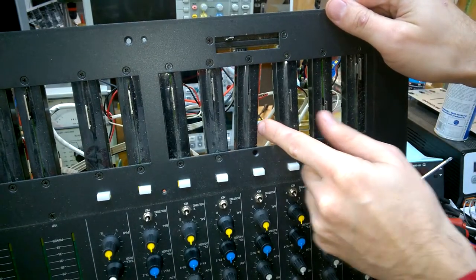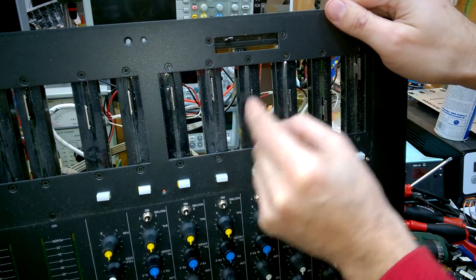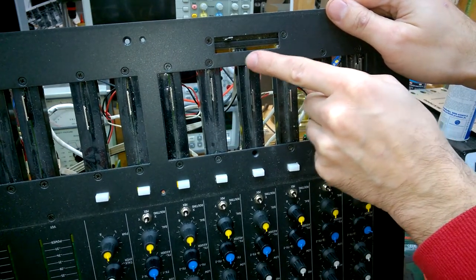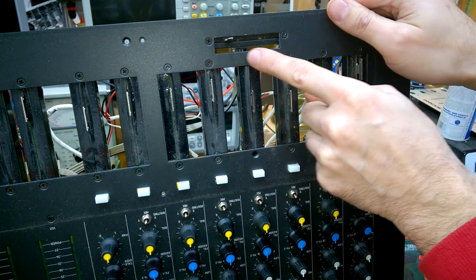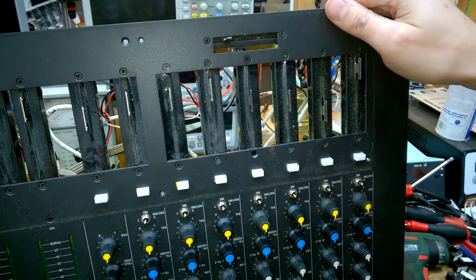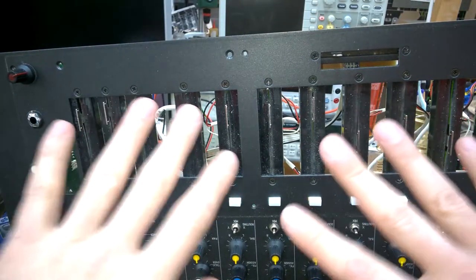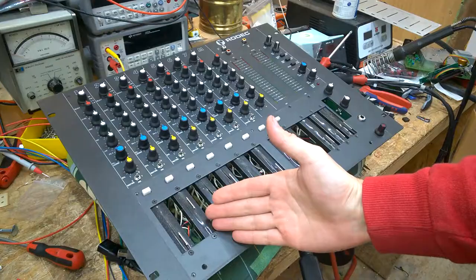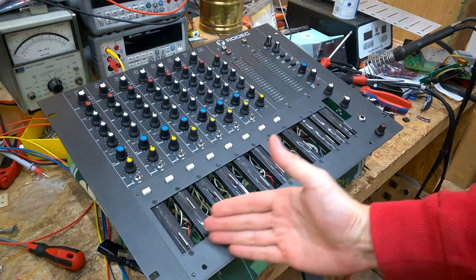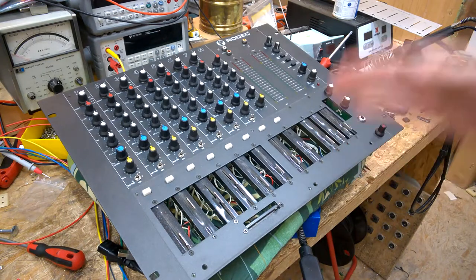This one is the loose fader. Look, this screw is not mounted too. So this was the problem. I'll put it back together now and then, yeah, that's it. I've double checked all screws, they are all fine now.